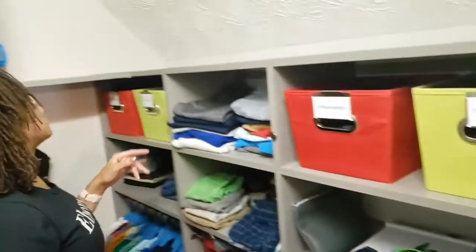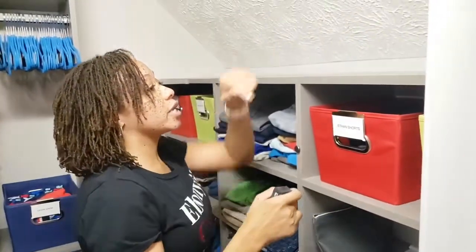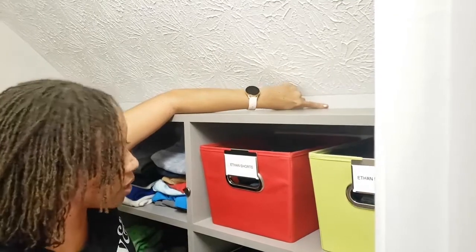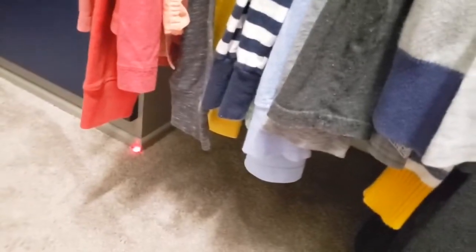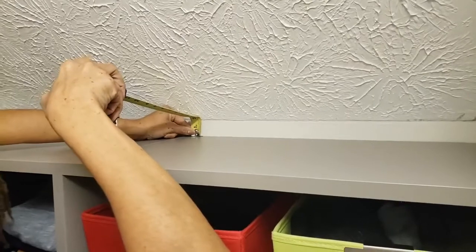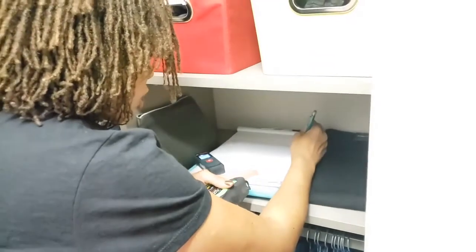Now we want to get our angle height. This is a little tricky because I already have a system in here. The angle height is literally the height from the angle point down to the floor. Since I can't get in there, I'm going to go from a nearby point down to the floor — and that measurement is 63 inches. Then I'll measure that offset, which is about one and a half inches. So we have 64 and a half inches for the angle height.